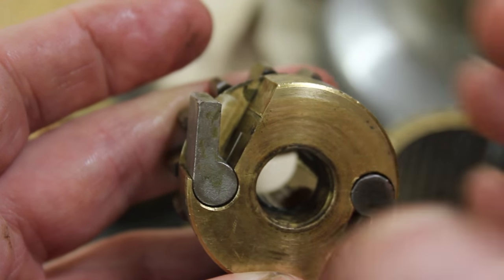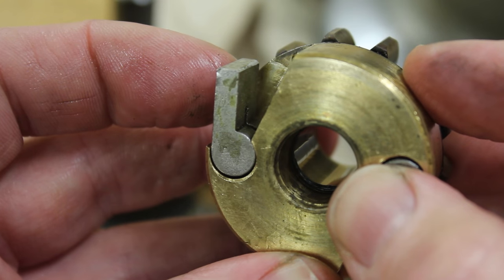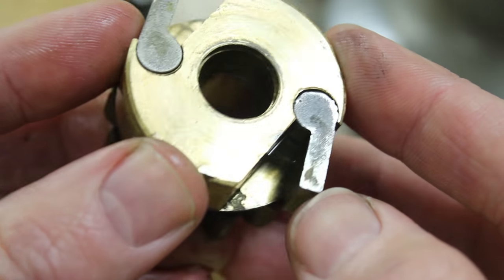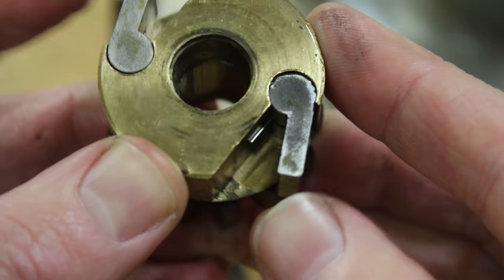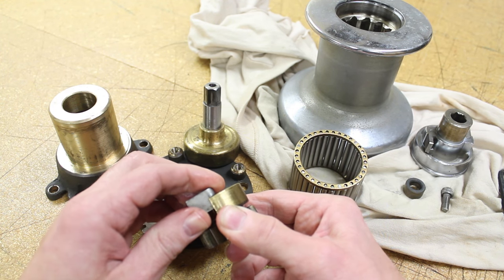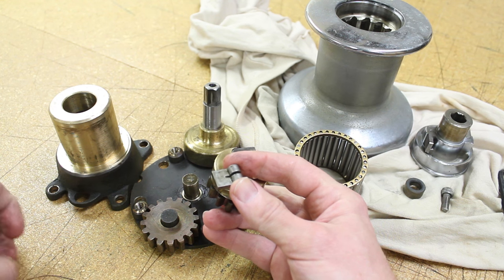Here you can see the way in which the pawl spring lays flat against that centerpiece and how the shorter straight piece falls right into that indent in the pawl. Removing the pawls, you want to be careful that you don't lose track of the pawl spring. Replacements are available for most winches, but if your pawl springs are in good shape, there's no reason not to keep track of them and reuse them.